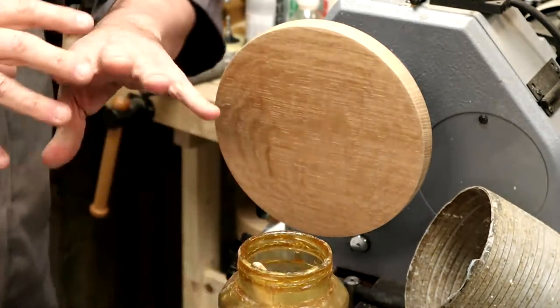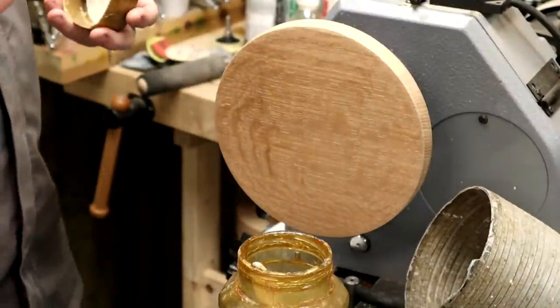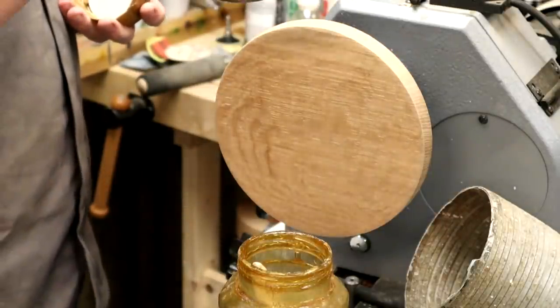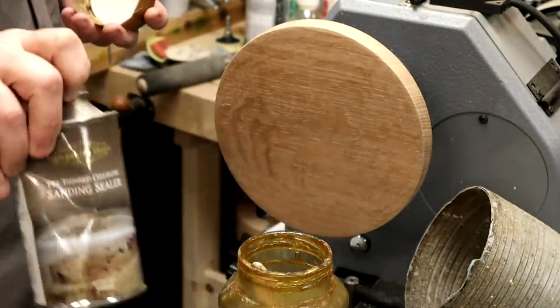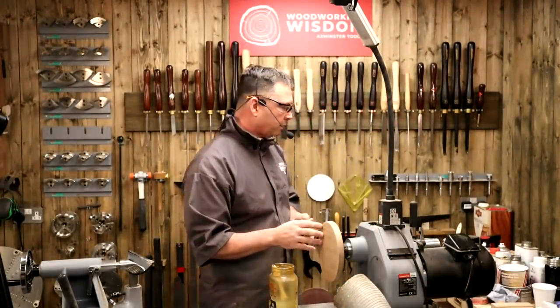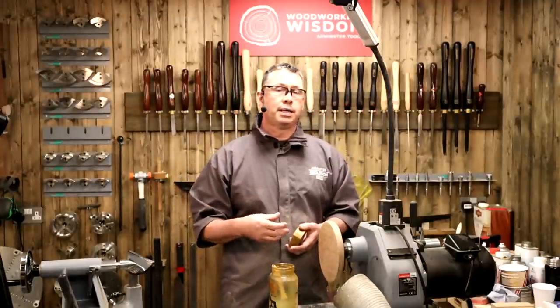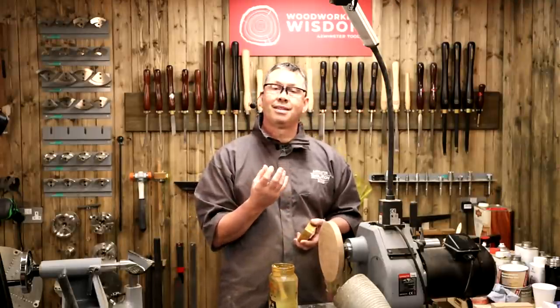I'm diluted here about 70% sealer and about 30% thinners. The Hampshire Sheen one there already comes pre-thinned, all ready to go. Okay, so that will start you off. I know it'll probably get me into a fair bit of trouble, but the manufacturer does say that you don't have to thin it, and they're dead right. If you've got a very punky timber, then don't. Just apply it and let it soak in nice and thick.